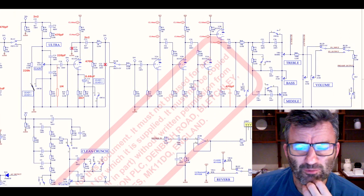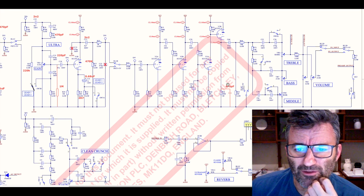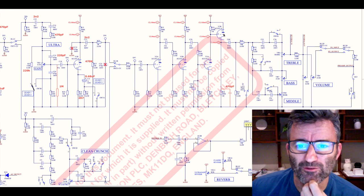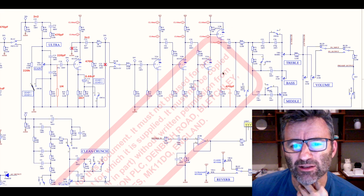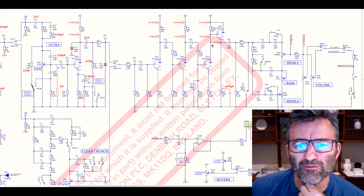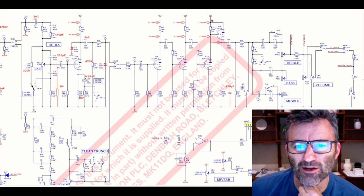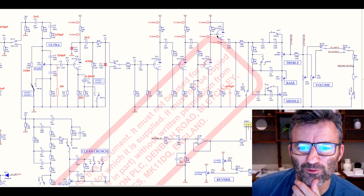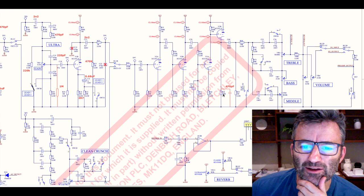And the last mod in the circuit is, again, a very common thing you'll see in a bunch of Friedman amps and other things, right on the cathode. This is the cathode follower now, right? So move some more gain stages here. We're back to some pretty classic looking Marshall setup. The 1K on this gain stage on the cathode, the grid of the cathode follower off the plate of the preceding stage with 100K up there. So this is pretty common, guys. We've all seen this in Marshalls. And then 100K to ground on the cathode follower.